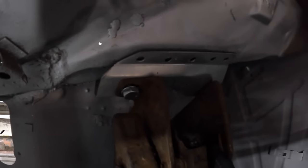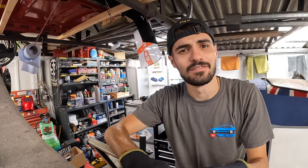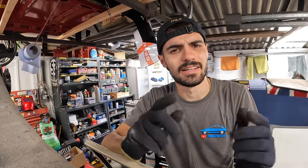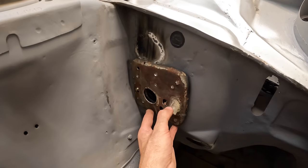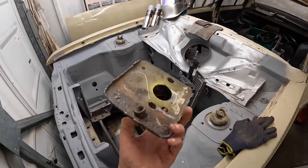It's all on now. This front section goes quite flush but the back one side slightly slopes down so I'll have to bend it up, but it fits pretty well. I've nearly forgotten to put something on - I'm pretty sure someone commented a few videos ago that there's an extra plate to reinforce the structure of the pedal box. I'm pretty sure I've still got it from the left-hand drive. Here it is - it's a big bulky bit of metal, about three or four mil thick. It fits on the inside just like that. I'm pretty sure this is where the clutch cable comes through so I'm going to have to make another hole there. But for the time being I haven't got long left in the garage today so I'm just going to bare metal all this.